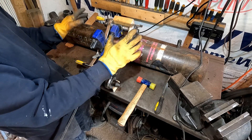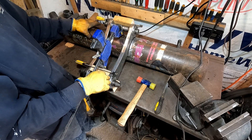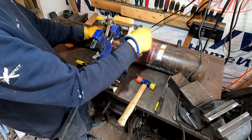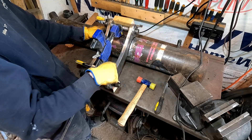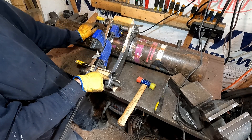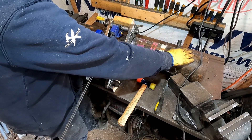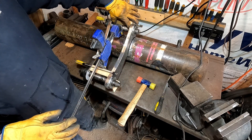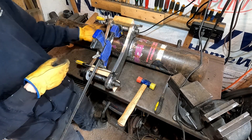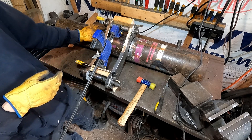That's all pretty straightforward. The rotations are trickier because there's nothing flat to measure angles to. A, which is rotation about X, is completely irrelevant because this tube is round and there are no other features on it yet — this can be anywhere. Everything I add from this point forward will be related in A back to these lugs, so I don't have to worry about it now. B is rotation about Y, and I did that with just a bubble level. I put a wedge on this side of this tube because my table isn't perfect, leveled the tube, and then checked level on the pin. I did a good enough job cutting these slots — they are parallel without me needing to shim anything, but I could have made an adjustment there if I wanted to.